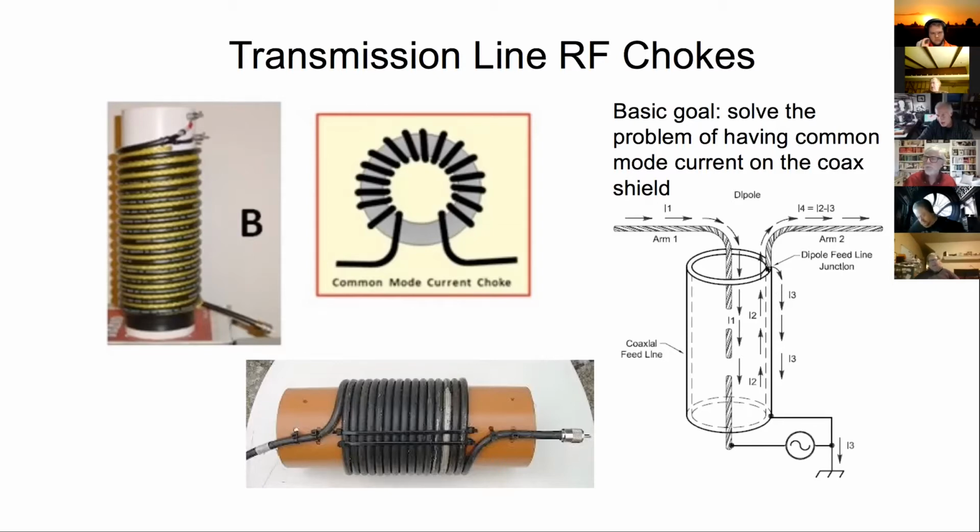Now remember, why you may ask, can you get two separate currents on the same conductor? So you get outer shield flow and inner shield flow. Well, the reason is the skin effect at RF. If you recall, skin effect is the fact that at RF frequencies in a conductor, the flow of the current is confined to the outer surface, or to a surface in any case.